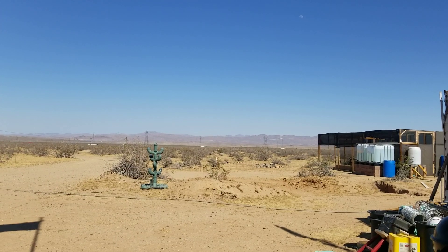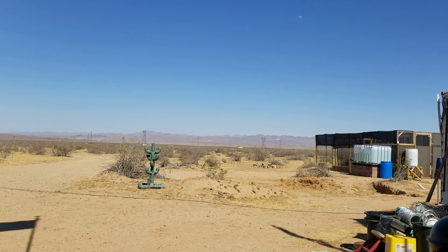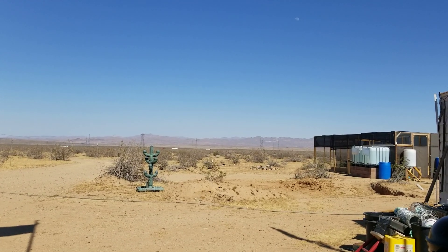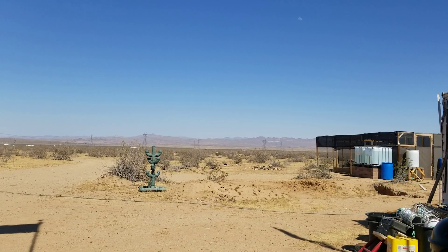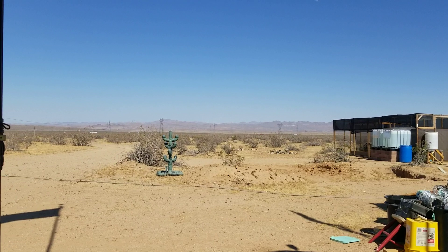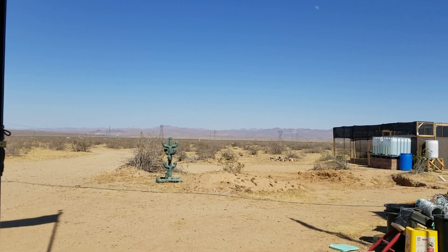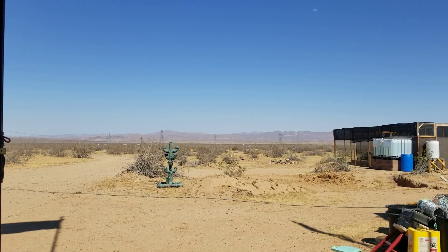It's going to be a waste of your time and money. Do like I did — get rid of that small wind turbine and get up to a bigger unit. I went to the KT5, rated for 1,685 watts. Remember, that's its maximum rating. I'll probably never see that — it requires 90 mile per hour winds, which is the maximum wind that unit will withstand before the blades stall. I have to get 90 mile an hour winds to get 1,685 watts. Forget it. You'll never see it, and if you do, it's going to blow your turbine down.